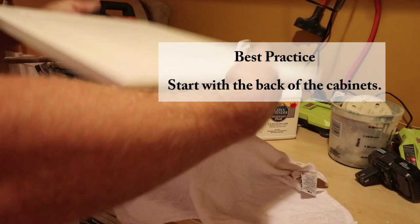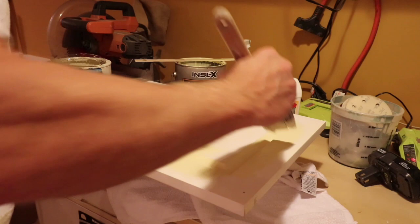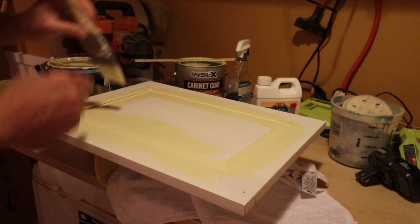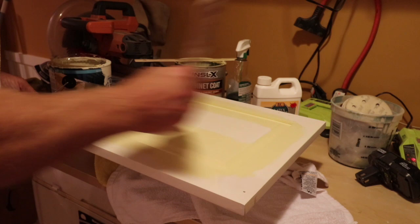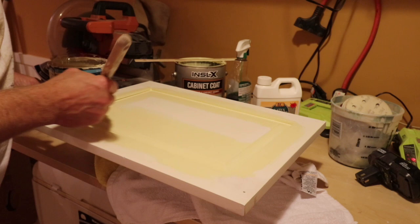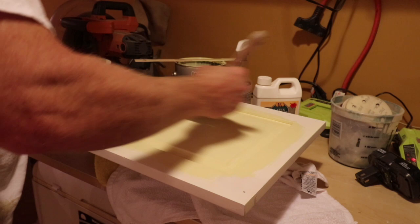When you do the cabinet door, you want to do the inside first — the most difficult areas first — otherwise you're going to be repeating your steps. What do I mean? If we did the flat side first and got the brush strokes absolutely perfect, we'd booger it up going back to do the detail areas. So always do the detail stuff first. The detail stuff on this is just all these edges. Let these brush strokes just do their thing nice and smooth.